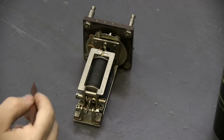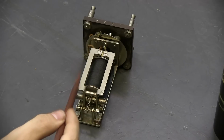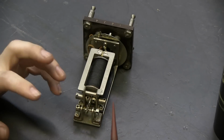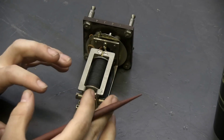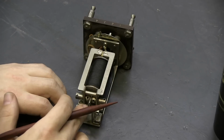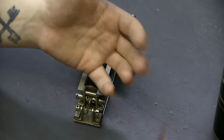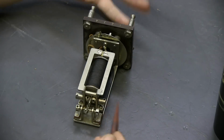So when the subscriber's dial releases and then makes and breaks those pulses, that's what operates this relay on the primary winding. The secondary winding and the tertiary winding are just helpers to make sure that this operates at exactly the right time and for the right length, because the operation and release of this relay affects a whole chain of subsequent events that have to happen at exactly the right time. Otherwise, the sender will record an incorrect digit.